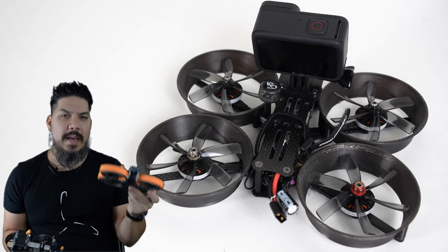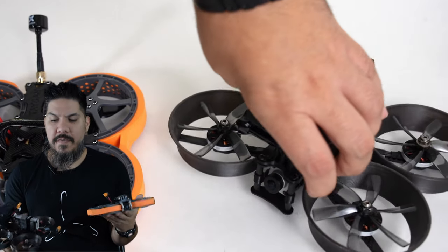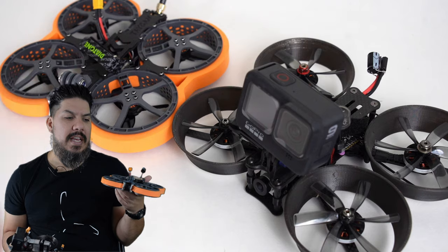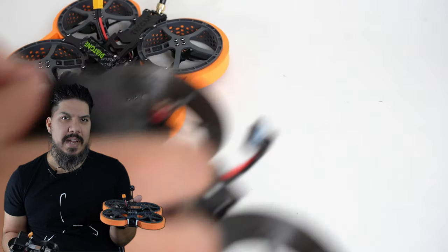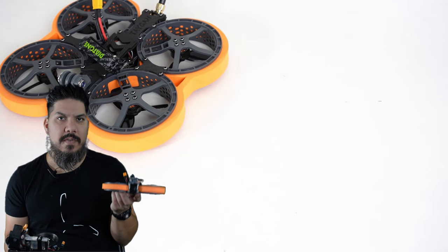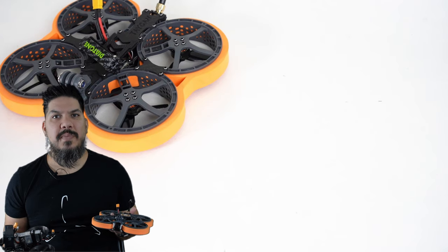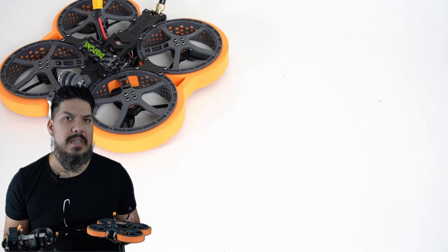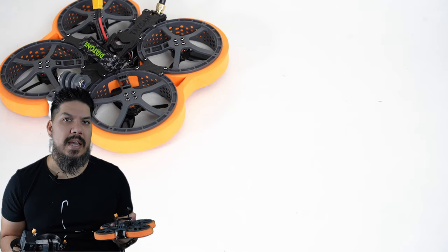Now, why do I say that? Well, here is a Diatone Taycan 2.5-inch version. And this thing really struggles with its 1404 size motors and 2.5-inch props to carry the weight of this. In fact, I would say that you can actually fly it smooth, but it just doesn't have the speed or the controllability or the battery life to be able to really fly it the way that you're gonna wanna fly